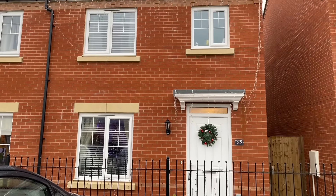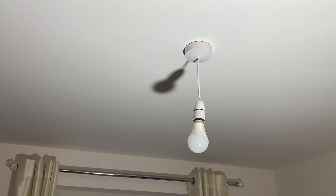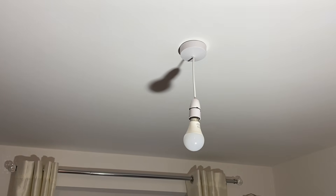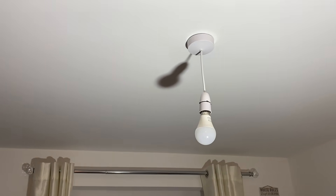I'm in a brand new house built in May 2020. In the kitchen we've got a lighting point just there and another lighting point just there. It'll be interesting to see when I take that cover down to replace that light fitting whether it's got the two plate method or the three plate method, because when this one comes on it also turns on the one over here. Let's have a look at the connections.